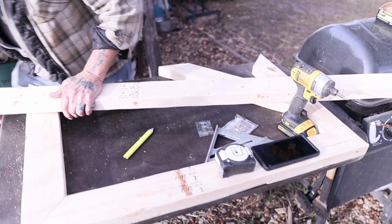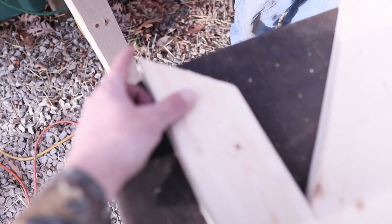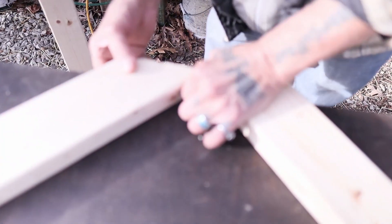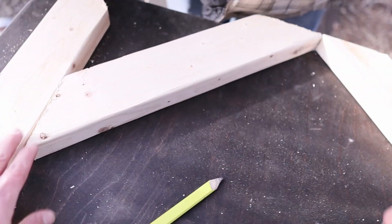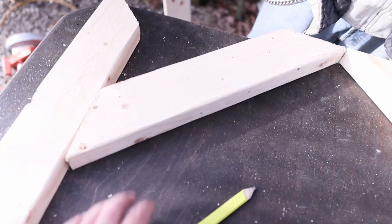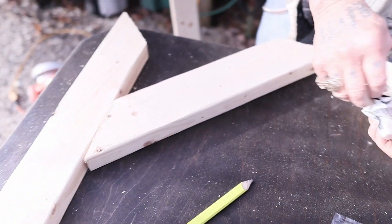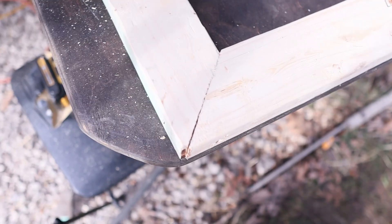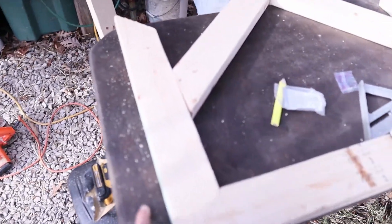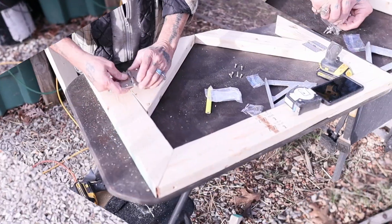It's really going to save a lot of room up there in the archery dojo. He marked the center from this corner to the other corner right there, so his first leg he was able to mount. Since he marked center he just laid this one up here even, put a mark underneath with the flush face of the plywood, cut it off at a 45, and put the hinges down. You figured out the 45 by measuring in three and a half inches — it's pretty cool, this thing's going to be tough and look good.